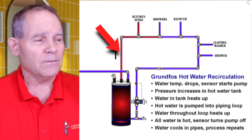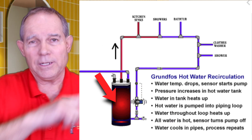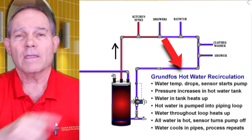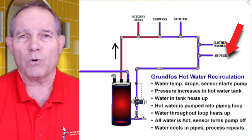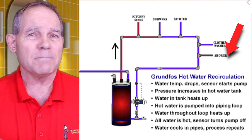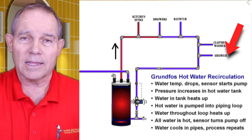A lot of these are installed incorrectly on residential homes. Commercial plumbers do them by an engineered drawing so they really can't screw it up. But with residential plumbers most of them have never done very many recirculating systems or done them by an engineered drawing so they really don't understand the concept. You're taking a hot water line from the water heater to the very furthest point just in a series of loops in a pathway. You don't want to go off that path.